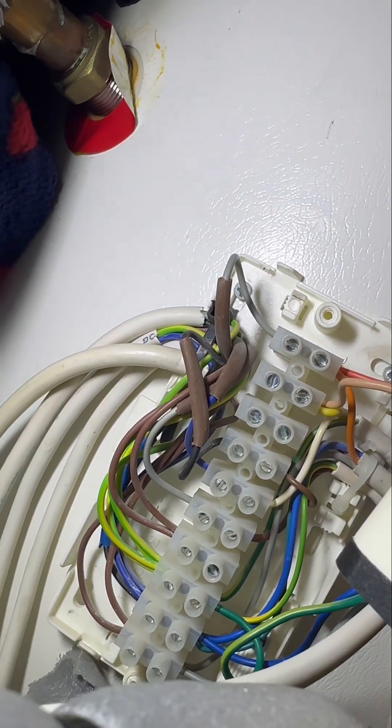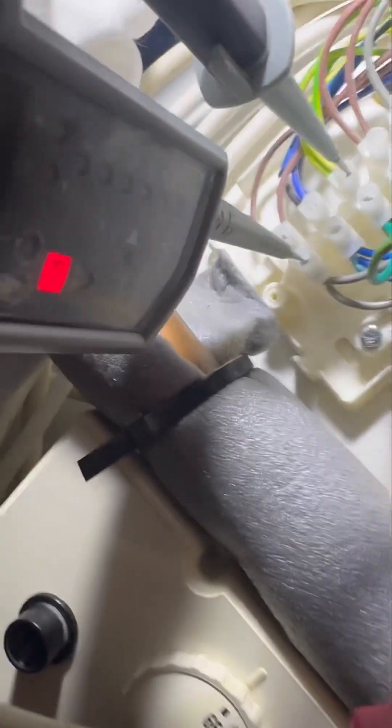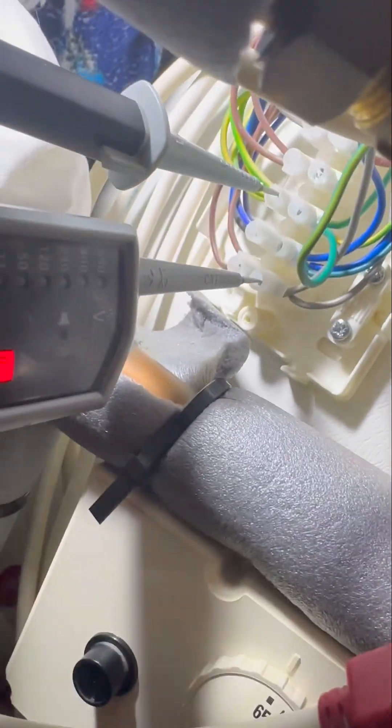The boiler was firing for heating. Looks like a wiring jungle in here, it's all over the shop. But we can start determining what things are by looking at the cables off the zone valves. We're looking for 240V on gray, which we're not getting.